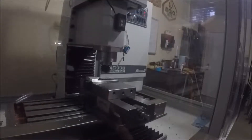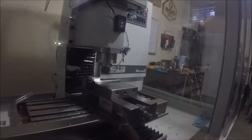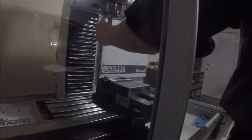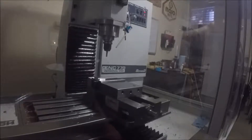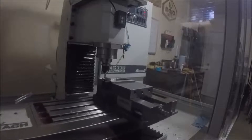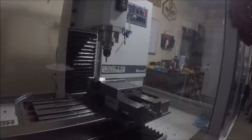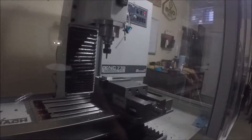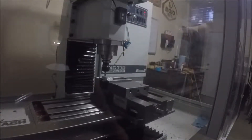After I re-zeroed everything and decked everything off with the Superfly again — and this is my first time doing this — I was overriding the feed rates because I wasn't really sure about feeds and speeds yet. I had an idea but I was still slightly scared. Here is the outside contour, and this is where it sort of didn't line up. That was pretty much a rookie mistake — I didn't have any sacrificial stock to hold onto on the bottom, so I was just holding on to the part that was still meant to be machined.